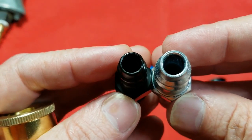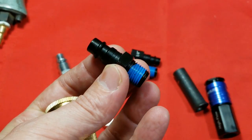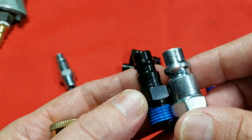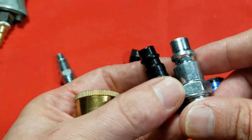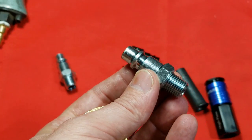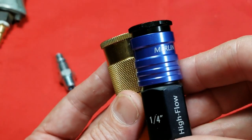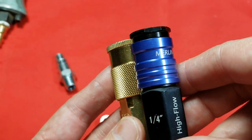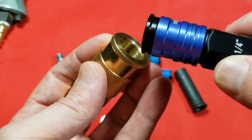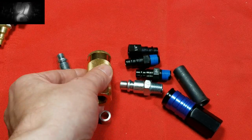The difference in size between both the female and male fittings here is huge. These 3/8" fittings are still a little bit larger — that's what these are. They're kind of like a proprietary small-size 3/8" bore fitting, but they took all the outside material away and made them a special shape so they won't even work on your old stuff or industrial shops that have permanently piped-in air. The coupler itself has twice as many seals, so twice as much stuff to go wrong. It is also not as thick, not as heavy duty, and of course it's aluminum, so getting pounded on the ground is definitely not going to hold up like traditional brass couplers.